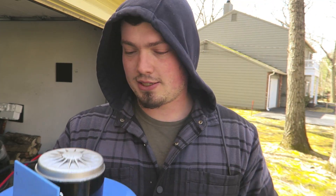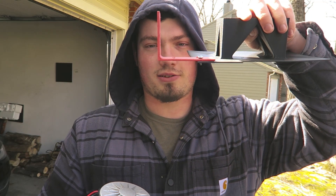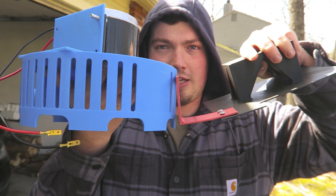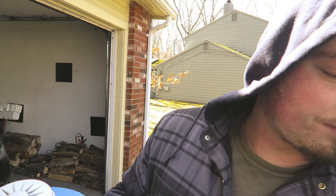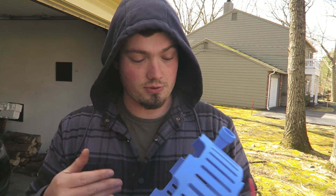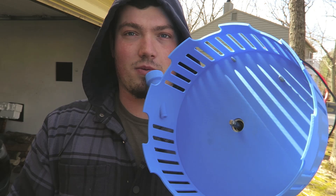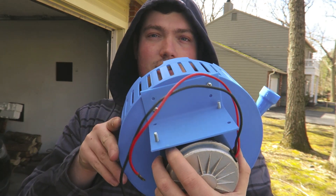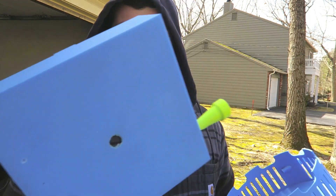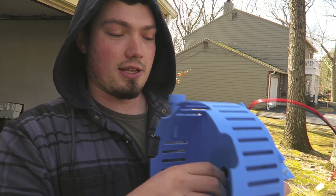So I might make a revision 4 that's kind of like this but also like this, so the nozzle can be varied and change the angle. I'd print a new plate and this nozzle moves. I do need to add more braces in because it's kind of bent, and with the amount of water pressure — I think like 50, maybe 60 PSI, I've never measured it but that's what it should be about — it still pushes that. This one shouldn't move really at all because it's built in there, it's pretty snug. This is actually PETG, while all the other parts have been PLA Professional or just normal PLA.